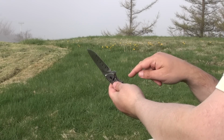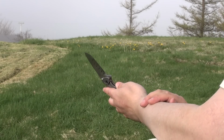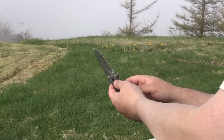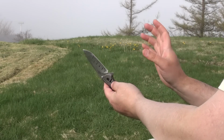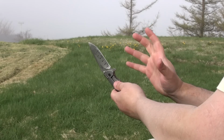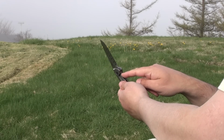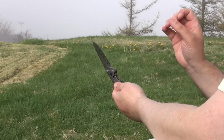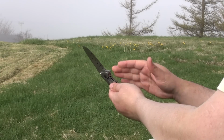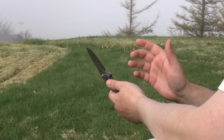Now, as a final note, Kylie Harris, the guy who owned this previously, did some relatively hard work with the blade and did slightly damage the lock face on the inside. So the instability that I'm seeing could be caused by that. But I've seen the exact same instability on locks which were absolutely brand new. And the thing that I don't like about liner locks and integrals in general is the whole security, not the strength, because the strength is very different. The whole security of this lock depends on the exacting geometries of this lock face. And it's really, really non-trivial to do right. And I've seen samples of the exact same knife from the exact same manufacturer be wonderfully secure and other ones be wonderfully insecure. And you don't see that kind of extreme variance on lots of other locks.